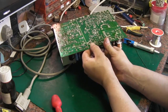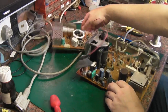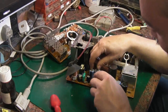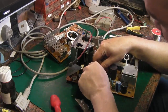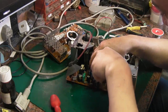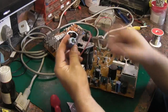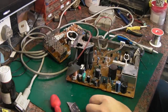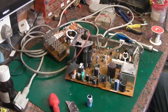I think electrically it's free — it's just stuck with that bloody gluey stuff again. They've actually stuck the two capacitors together with it, so let's cut through that. There we go, out you come. I think that's been leaking as well — you can see that on the bottom, either that or it's electrolyte that leaked out of the other one. Let's get the capacitance tester out and see what it says.